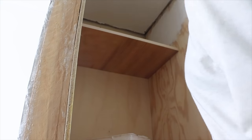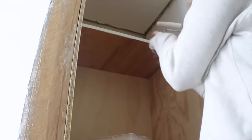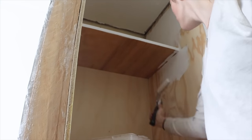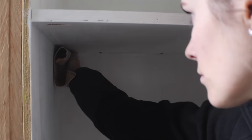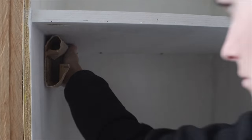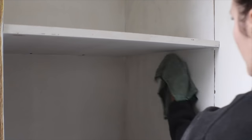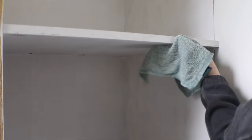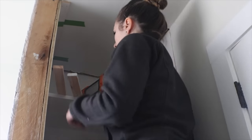I used a four-inch mini roller with a three-eighth-inch nap and just rolled primer on here. When the primer was dry I came across with 220-grit sandpaper wrapped around a little 2x4 block and sanded everything smooth — before this I hadn't sanded the plywood, so this is really prepping it to get a nice smooth paint job and catching any drips. Then I wiped all the fine sawdust off with a damp rag.